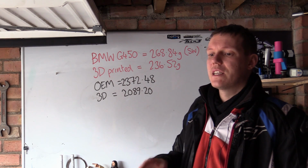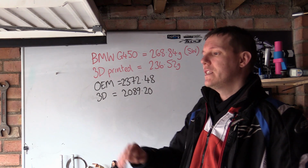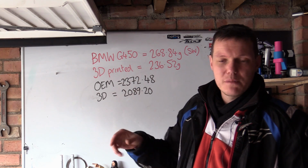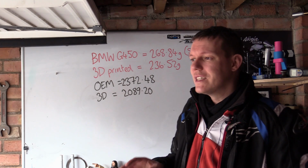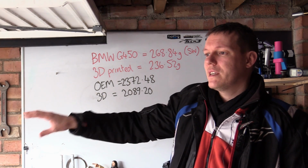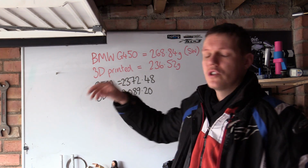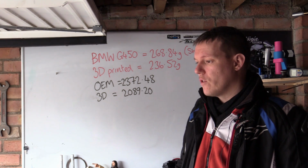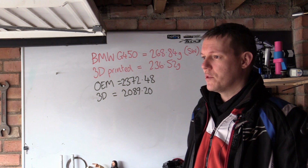However, talking about manufacturing, a lot of these things still need machining, so they will do everything undersized. So you still need to do the bore, you still need to bore the wrist pin, gudgeon pin hole, things like that. So it's either get a billet, or a casting, or get a casting that is then forged, and then you do the machining anyway. And the casting and forging process is extremely quick, especially the forging process.